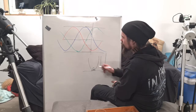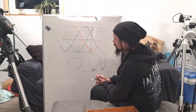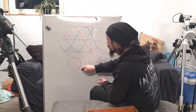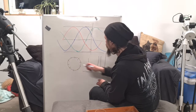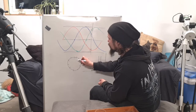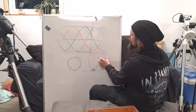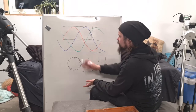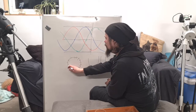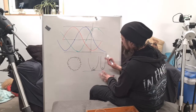basically that's the construction of the motor. In this case, my motor has got a certain number of magnets. And that gives me 15 segments around the motor on which I move. And that basically corresponds to the width of this, yeah? And if I would add magnets, doubling the number of magnets, that basically would mean making the cup narrower, yeah? But it's fairly inconvenient to make that into a solid solution, because you will have a lot of magnets. That would be inconvenient as well. So an encoder is the solution for this.